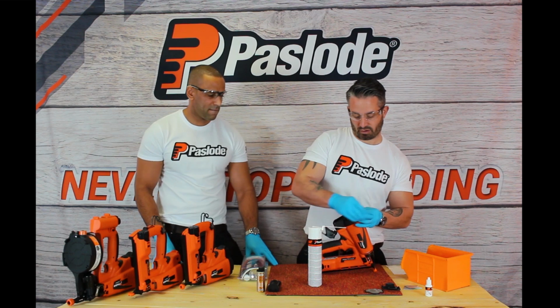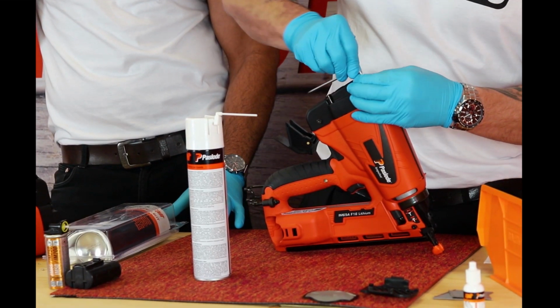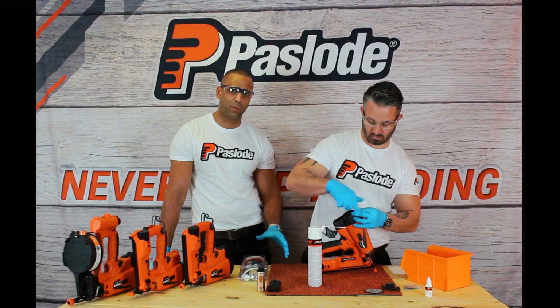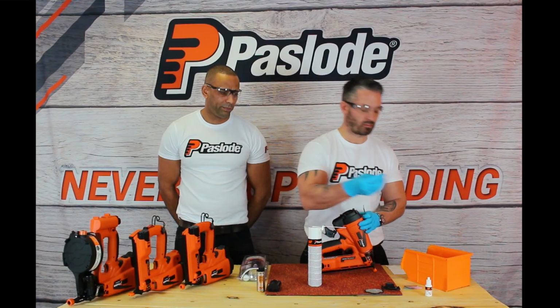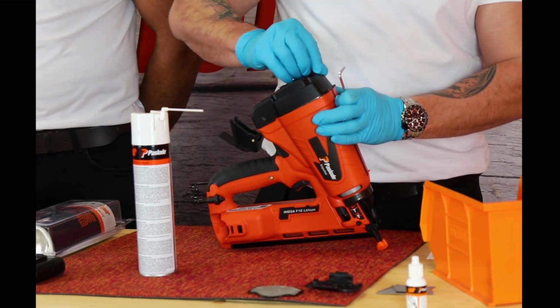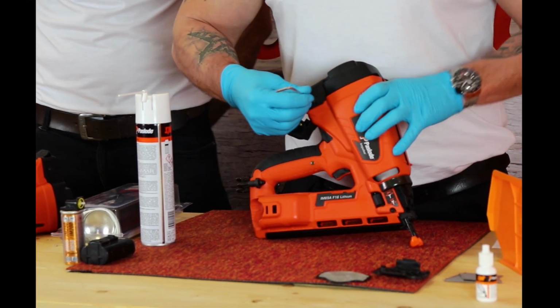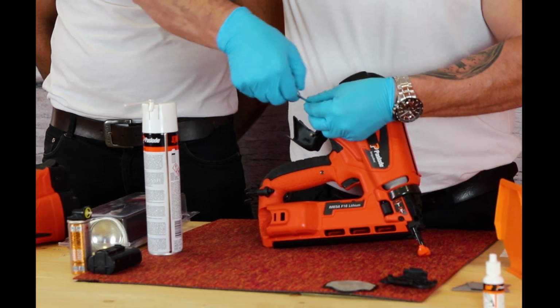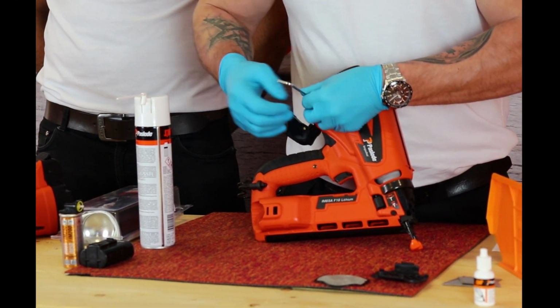That's what I'm doing here. I'm removing the shoulder screws. Avoid using any power tools at this stage. The Allen key provided in the kit will do the job perfectly. Okay, so removing the shoulder screws and keeping them carefully in the box so we don't lose them. So just finally remove the little side screws. They're grub screw size, so they're very small, so be careful when you're handling them.